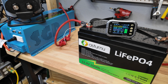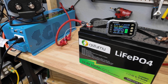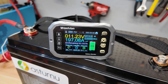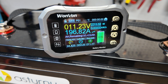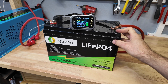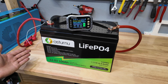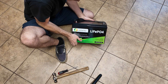Voltage recovered a little bit. I'm going to add more load — plugging in a 30-amp battery charger. Turned the heater back on high. Something is complaining, probably because the voltage is lower. At 11.2 volts we're pulling 195 amps — not shutting off, that's a lot of power. The inverter is not happy. I'll call the test there at 196 amps. The fact that the high current protection doesn't work means you could probably use this in a golf cart and not have too many problems if you're not pulling more than 190 amps.